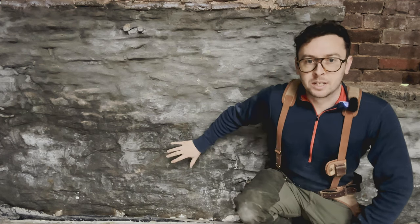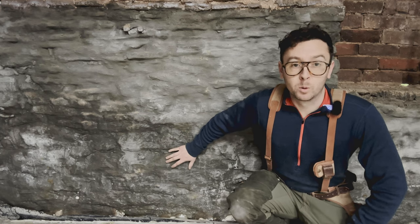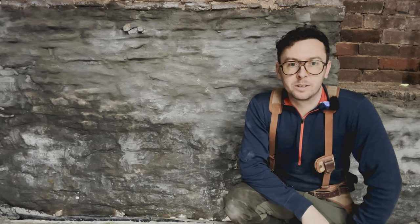It's not necessarily true. And in this case, what I believe happens quite often, certainly in this situation, is cold spot damp. So if this wall, where it's below external ground level, is all quite damp, it's probably also going to be quite cold. The wall is much colder here than it is here, noticeably to my hand. And because we've got liquid screed in here, it's gone down recently, and the building's been open to the elements whilst we were getting the roof on, there's a lot of water in here.